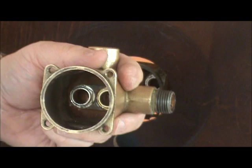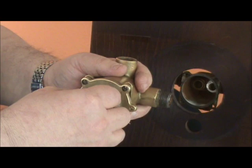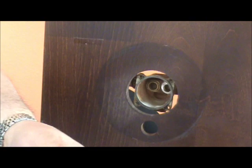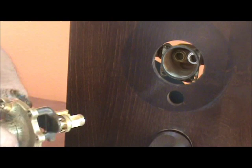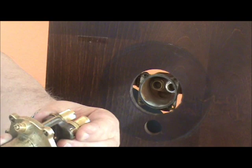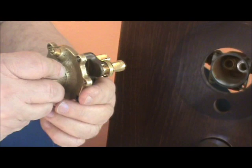You can look inside here at how this is built — there's a little shelf inside. I've got another sample to show you. There's a little indentation that dictates how it goes back in there; it goes opposite of this bail right there. So in a shower-only application, that would be up and the other down. For our tub and shower setup here, we're going to flip it back — round up, square down. This is the way we'll hand it back to you when it's done, with hot on the left and cold on the right.